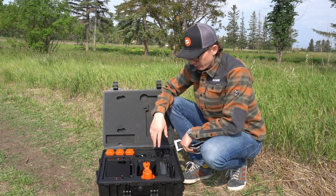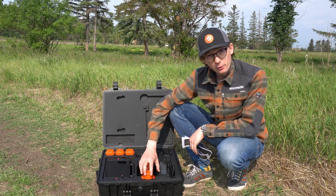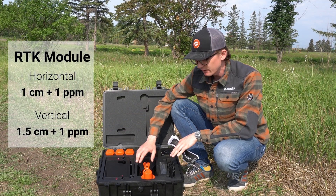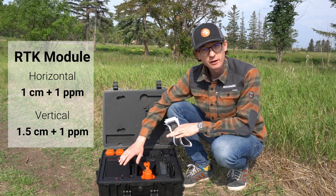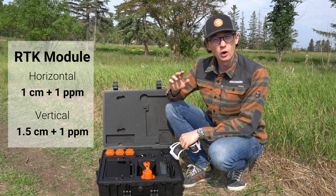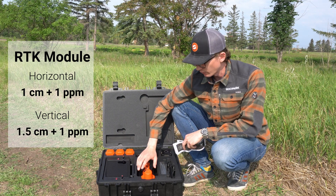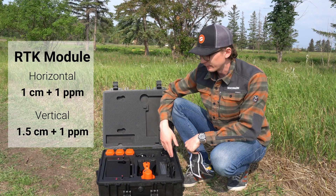The first thing we're going to look at is the RTK module. The drone's got this kind of forehead-looking thing on it and this is the RTK module. This will give you centimeter-level positioning — it streams the data from the data collector to the RTK module. We can hook it up with any of our local Ntrip networks, whether that's CanNet, SmartNet, your own custom Ntrip network, or our proprietary Stormcaster network. All of it works with this drone, we've tested it out, it's been working great.